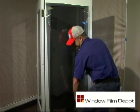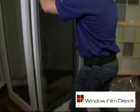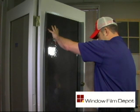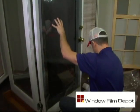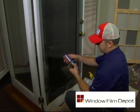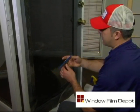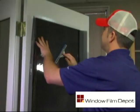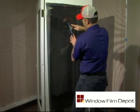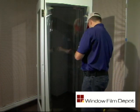If you are using the right mixture of soap and water, your film should be movable on the glass. Make sure you have full coverage. Wet the surface of the film to provide slip, and use your blue squeegee to lock down the film by pressing a T-shape into the center of the window. Make sure the angle of your squeegee is such that the edge of the blue blade is pressing the film into place. Do not take the squeegee all the way to the edge of the frame during this locking down step.